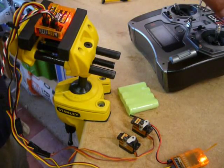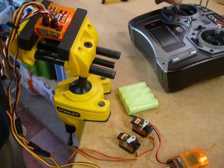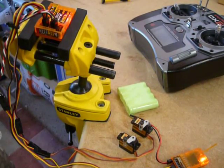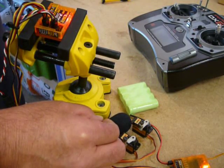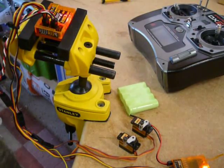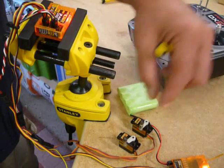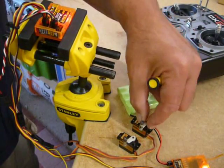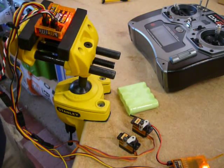Now, with the flight stabilizer hooked up, everything still works as it should. But I want to hold the microphone down to the servos again — and this is the reason for doing the control test — and you can probably hear them buzzing away like crazy. Actually, in a model that will translate to quite a little bit of movement on the control surfaces, obviously depending on how your throws are set up. I did wonder if it was something to do with the gain controls here, but moving the gain controls throughout the whole range has absolutely no bearing on the amount of jitter around the neutral point.